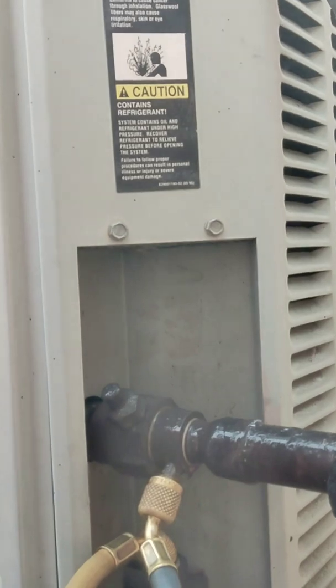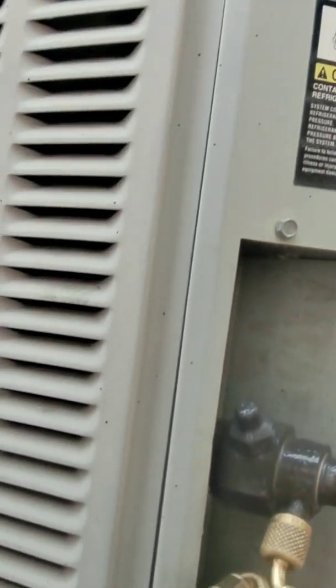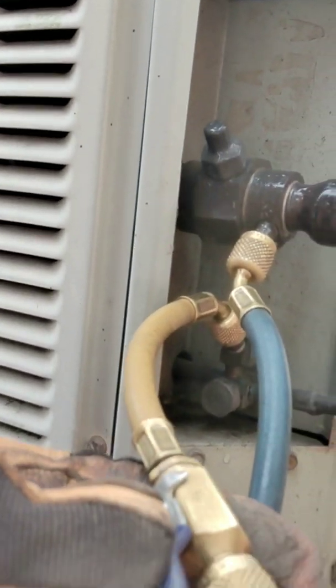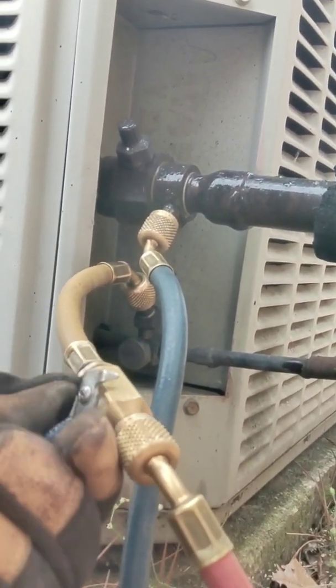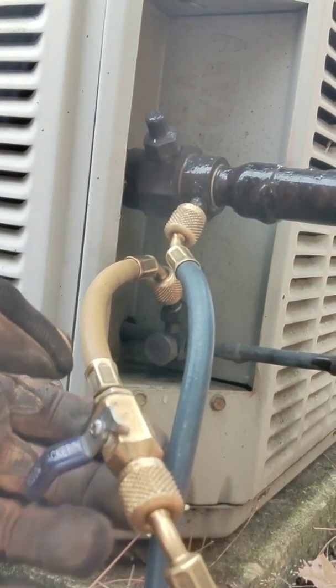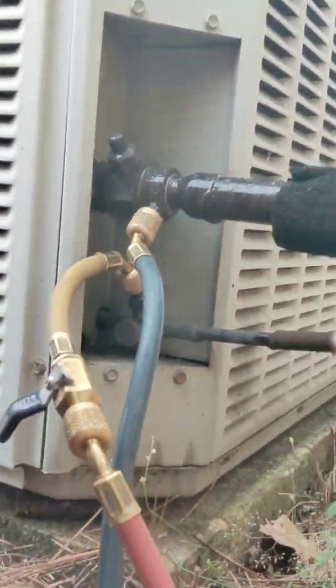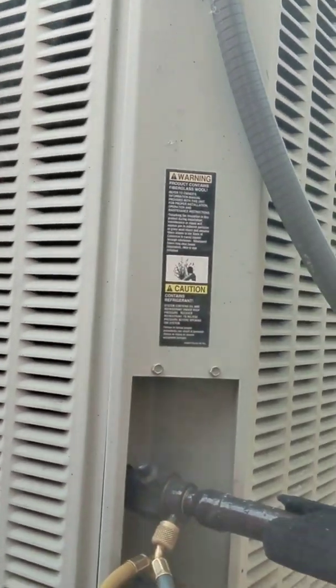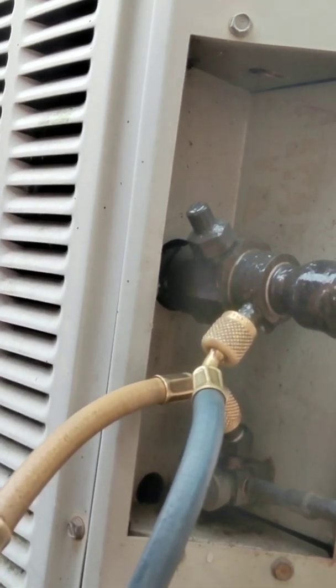Come over here to your high side, because it will trap that liquid inside the gauge. So you want to cut that bad boy off, and now you've got all of the liquid trapped inside of this hose. It's still hooked up — you've got to do this while it's running.